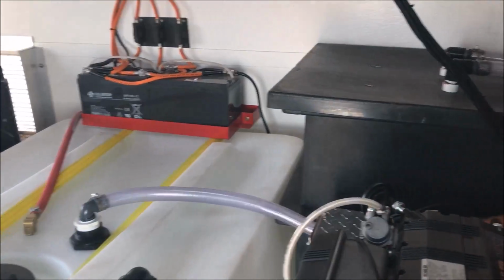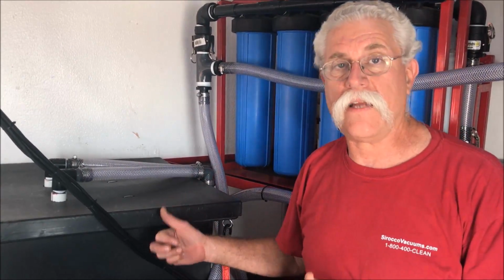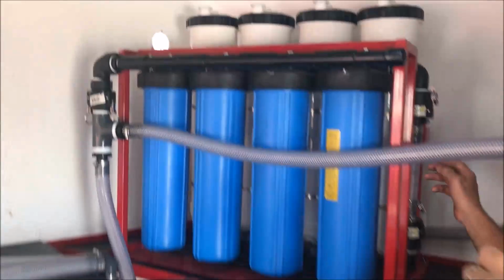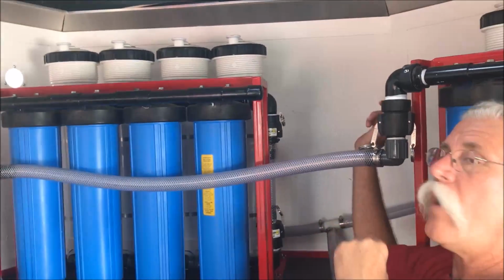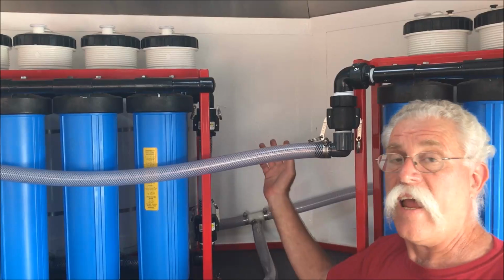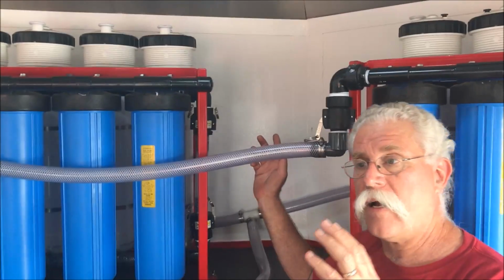From the oil water separator, we pump out. There's dual pump outs in the oil water separator. There's actually 2 of them in there, so 25 gallons a minute each can be pushing water through these banks of filters. So I've got actually 2 banks of my white filters, which bring the water down to about 20 microns, and they have huge cleanable cartridge filters.